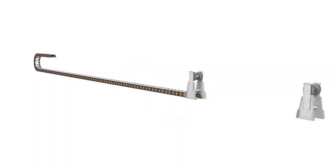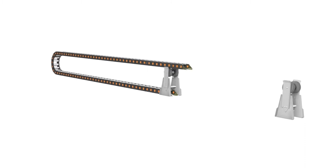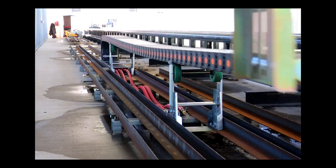Standard support rollers are an alternative to a low-mounted carrier in a guide trough, but are limited to travels of 48 feet or less. Fixed rollers cannot be placed in the area where the curve travels, where they will become an interference point.